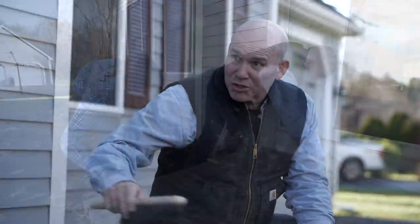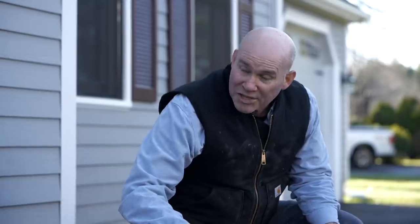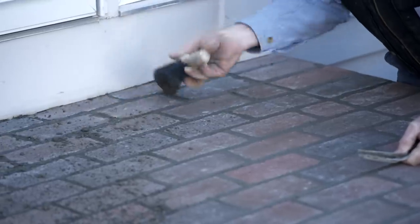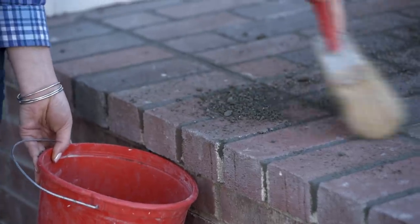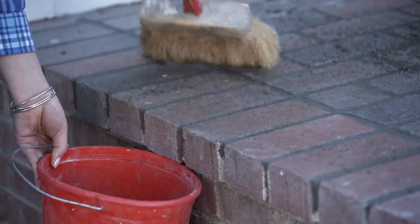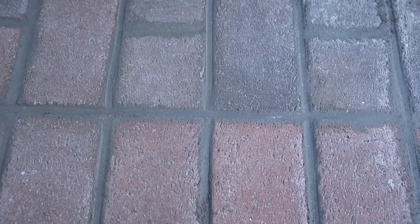All right Michaela, I'm going to brush toward you, and we're just going to brush very, very lightly. You notice we're breaking the skin of the mortar — no problem, because we're going to come back and fix that. The mortar's coming off so cleanly. Take your time, be neat. Then we're going to take our flat joiner and run it one more time. You can see what we call the cream come back up in the mortar — that's a slick joint, and a slick joint is weatherproof.